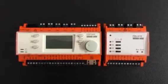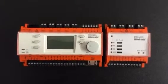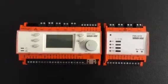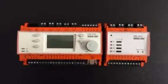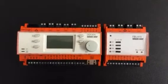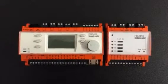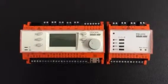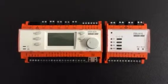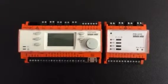In order to make a connection, please observe the wiring recommendations on the datasheet for the FBU 410 and also the DDC 420, especially when it concerns distances of the modules spread over the data connection. If we had three FBU modules located in the same switch control cabinet or control panel, the DDC 420 would be able to power all of those modules. As soon as we have a larger network range, we may have to introduce an external power supply for the modules, and that's quite normal. We do offer power supplies on our website www.6sense.com or you can contact us for further details.